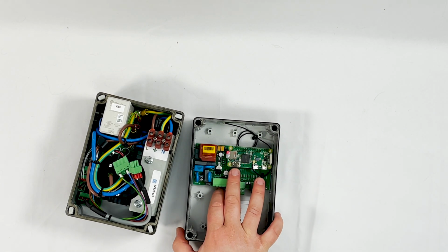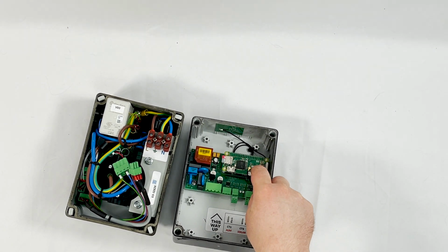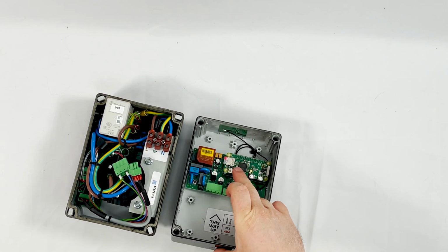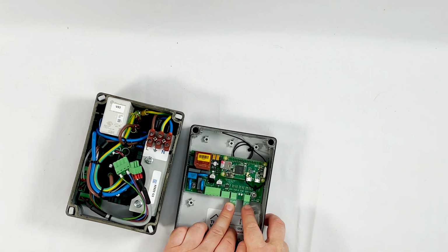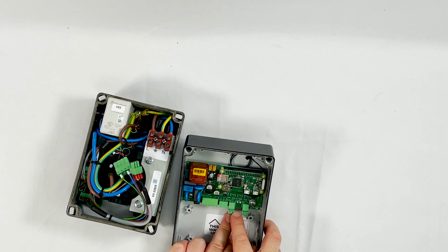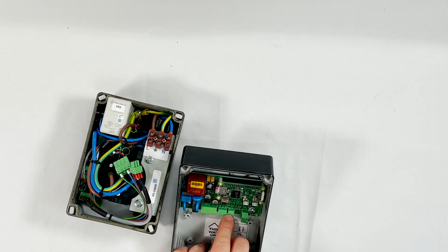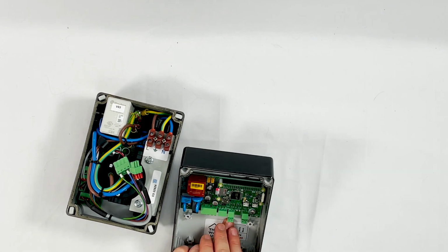There's also a USB type socket here, and then some other USB type sockets here. These look like USB-Cs, I guess, and this just looks like a standard flat end USB. We've also got two CT clamps here. They're labelled 1 and 3. 2's not soldered on. I'm going to assume there's a reason for that, but that means you can do load balancing and solar divert with the system if they came with it, but it doesn't come with any CT clamps.